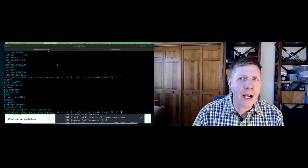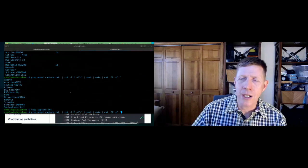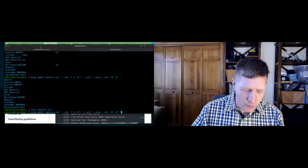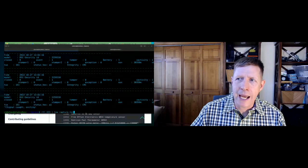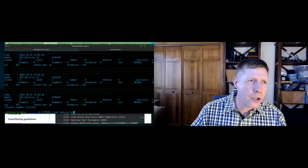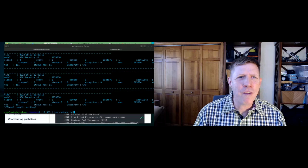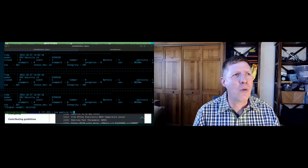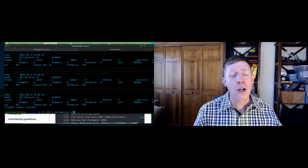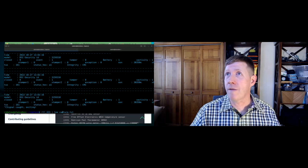The day that I did this, I ran my RTL-433, right? I'm going to Control-C this. Just ran it like that, RTL-433, T capture. It defaults to 433.92 megahertz, grabs all this stuff. And I ran it for like 24 hours just to see what's around me, right? What could I actually find? RTL-433, really, really cool stuff.